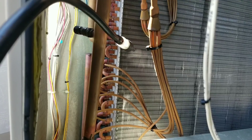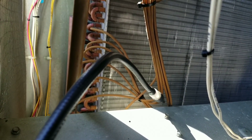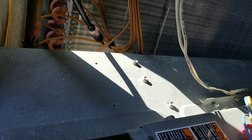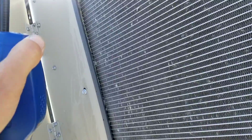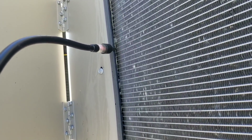Not getting anything around here. Over the years I've found leaks all over these distribution tubes, only because they're always touching each other, rubbing up on stuff they shouldn't be rubbing up on. In my experience, when these micro-channel coils leak, it's usually over here at the header — or what I call a header. I don't know if that's technically what it's called.